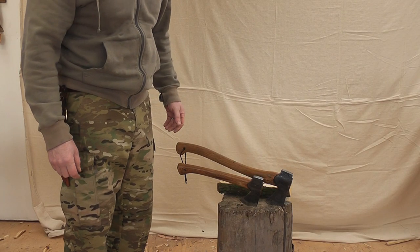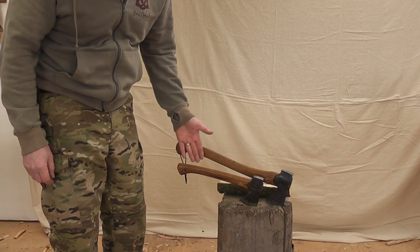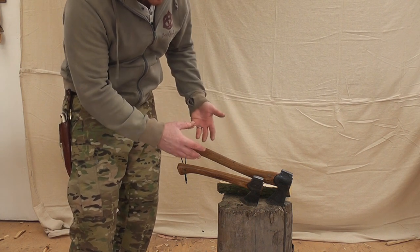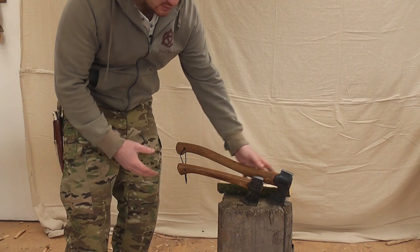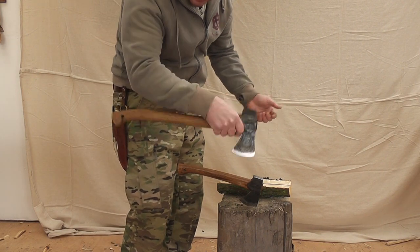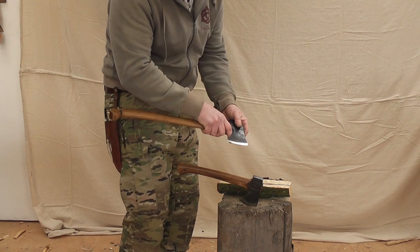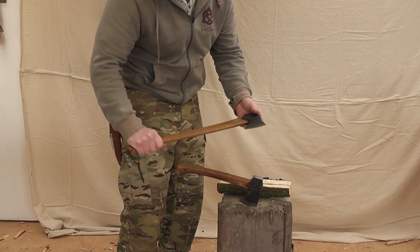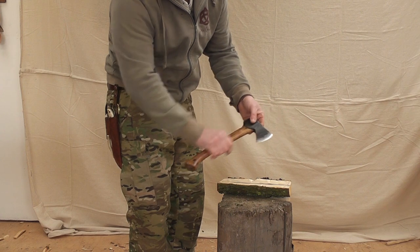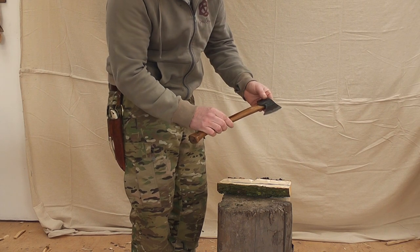These are two Greenwood axes. We've got the small forest axe at the back and the wildlife hatchet there. Just wanted to show you the pros and cons of the two tools. For close quarter work, for craft work, you can use the small forest axe, but there is a little bit of a danger that because you're holding it close to the head, this long handle can snag on your clothing and interfere with your body. So if you're not having to do any heavy chopping using a long handle, I prefer to use the little light wildlife hatchet like this with a much shorter handle for this controlled work. And we'll show you how to safely use this for the spoon preparation.